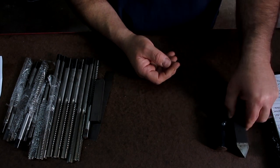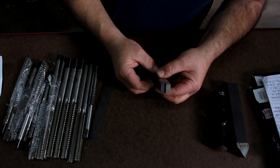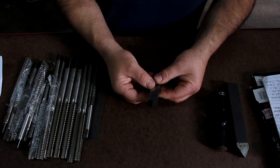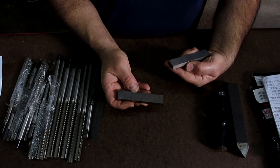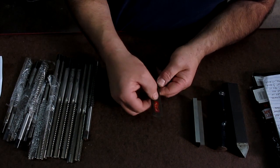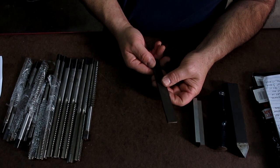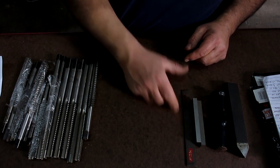Then there were a couple of rectangular tool bits — these are always good. These make good trepanning tools because they're tall, so you can get some strength under that edge. They also make good parallels with two sizes to work with. These are Armstrong — two Armstrongs. And here's an old-school parting blade — this one's tapered and it's a Williams, three-quarter inch blade. It says 'new' on it, so it's an old parting blade that's never been used. I don't know if I have a holder that fits this.